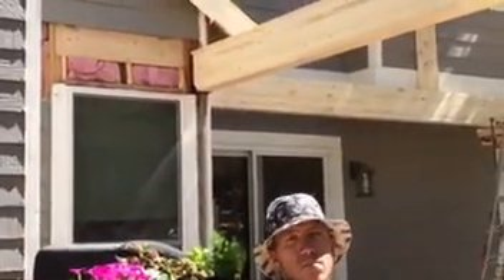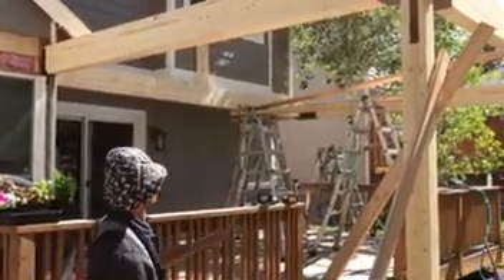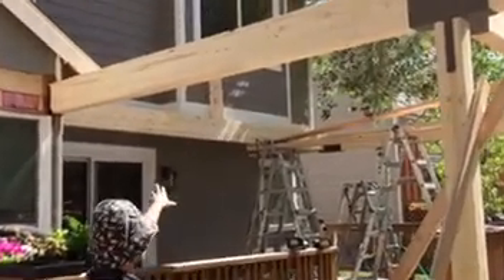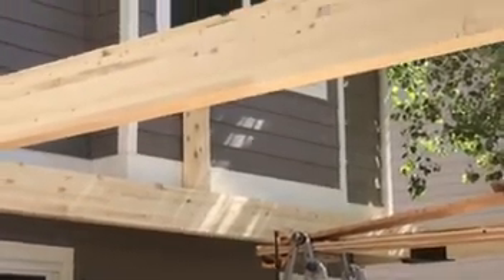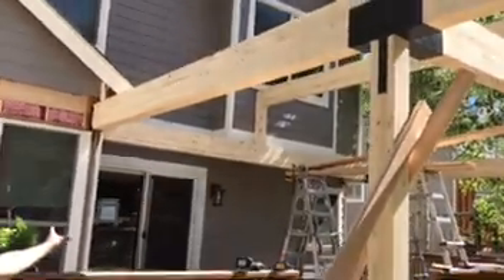If you don't have those proper studs, you've got to make sure they're in there, so check with your engineer before you post anything to the house. In this case, because there's a cantilever coming off the house — that part of the house that bumps out — we're actually not allowed to attach to there, so we put a freestanding beam hanging off of our beam over there and also posted it into the house on this side.